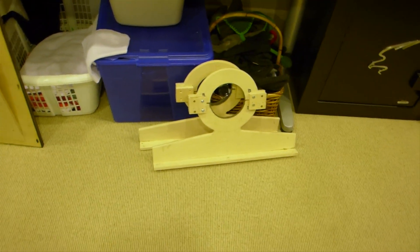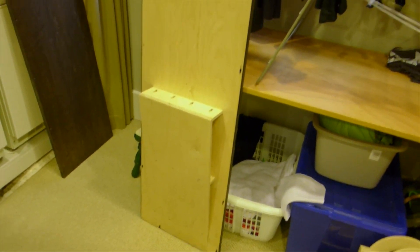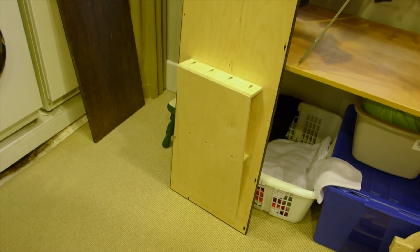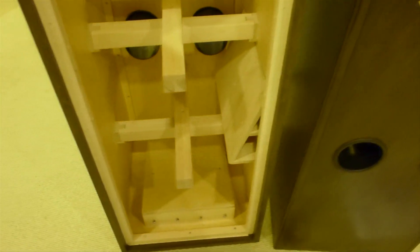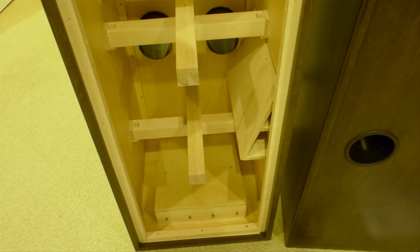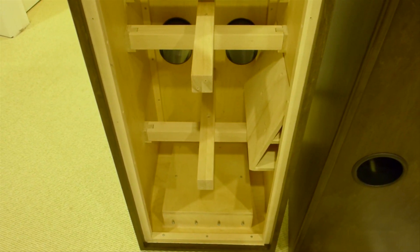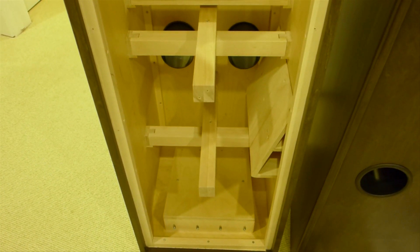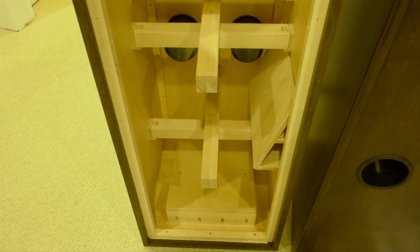This top brace is to support the back of the speaker. In conjunction with the angled plate on the back, we have several other angled plates to break up standing waves. Then there are different types of sonic barrier: 1.25-inch insulation, plus some regular foam and some fiber insulation that I'm going to put in different places.